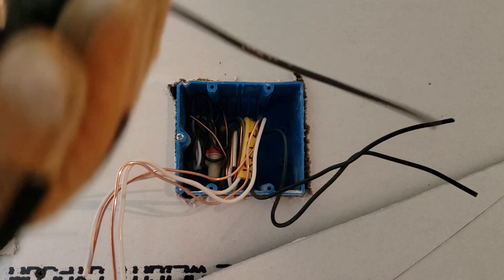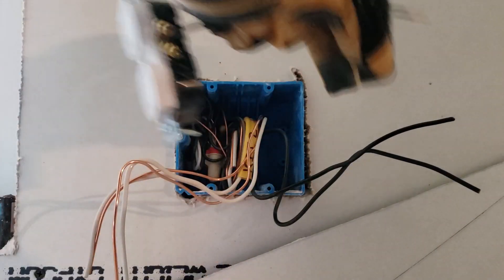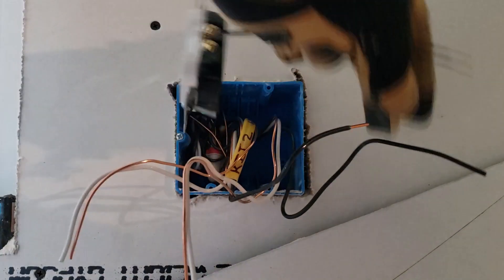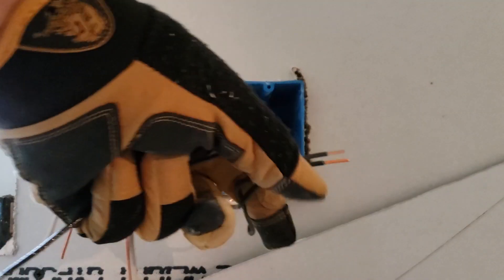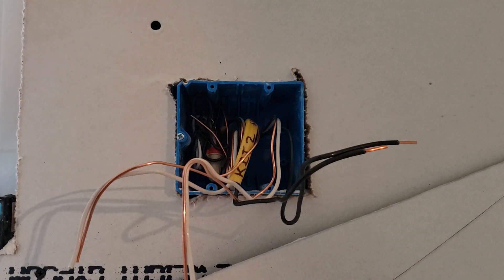For the device pigtail, use a wire about six inches long and pre-strip everything. I usually give myself about five-eighths of an inch. Strip all three wires — the pigtail wire on my device and then the two wires in the junction box.